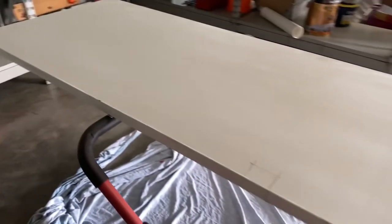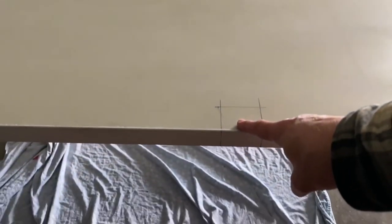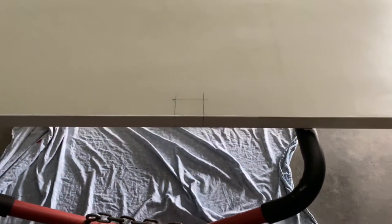The tools I've used so far are just a simple set square and a pencil. I've measured that out and come roughly about a metre up from the bottom of the door to get the right spot - a nice height for people to use that latch. What I plan on doing is drilling holes in each corner, probably from both sides, to try and meet them in the middle. Then I'll use a coping saw to cut across and a fine hand saw to cut down the sides.